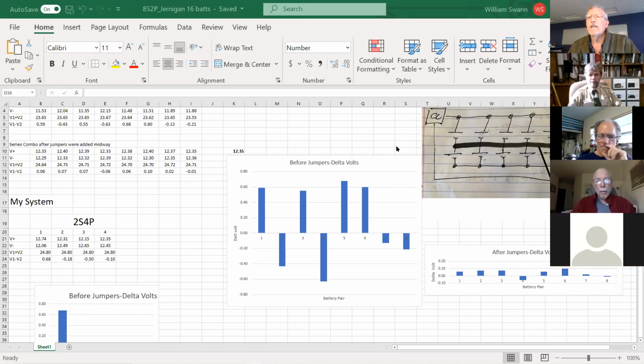I do. All right, yeah. In the automotive end, when your electrical system isn't functioning properly and it's directed towards the batteries, a third of the time it's your connection. The connection to the battery, even though it looks solid, if you take it open and clean down to the copper and reassemble it, and they even have conductive solutions you could put into this. And if that's not it, then the connector to the battery always seems to be problematic also.